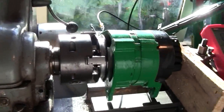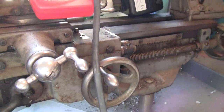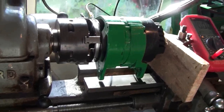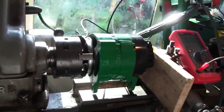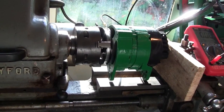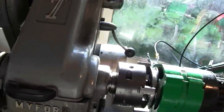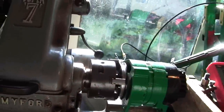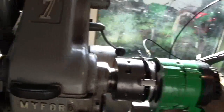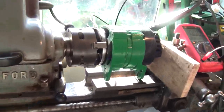What I'll do now is measure the speed of the engine. According to the ratings plate on the side of the engine it revs up to about 8,000 RPM, though I'm not sure whether that's a reasonable running speed. I'll start the engine, measure the RPM when it seems fairly high but not going mad, and then work out the ratio needed from the engine to the alternator to drive it at just over 2,000 RPM. So instead of a 2-to-1 reduction I might need a 3 or perhaps 4-to-1 reduction, and then I'll make a pulley.